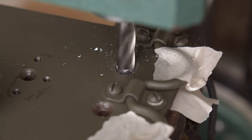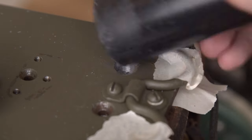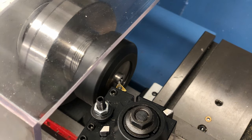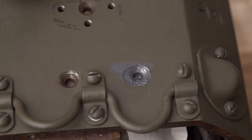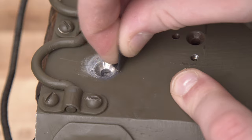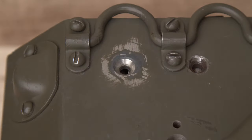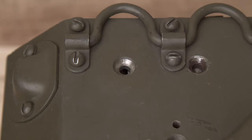To fix the problem, I started by boring a new cylindrical pocket concentric to the location where I wanted the countersunk hole. Then I turned a countersunk steel bushing and glued it into the pocket using epoxy. I applied excess epoxy to the repair, then shaped and sanded the area to create the geometry I wanted. The whole process cost me a bit more of the original paint than I would have liked, but luckily it's pretty common to see touch-up paint on equipment of this sort. I think the color match came out looking pretty good.